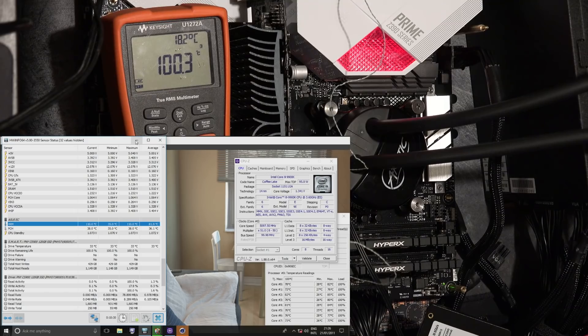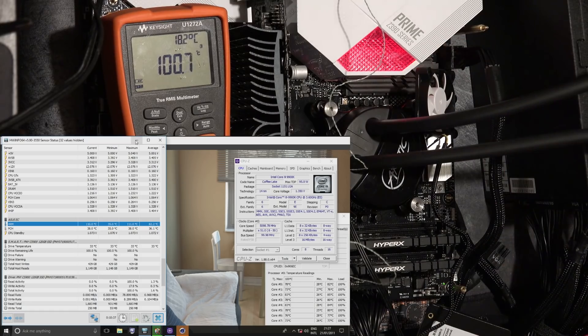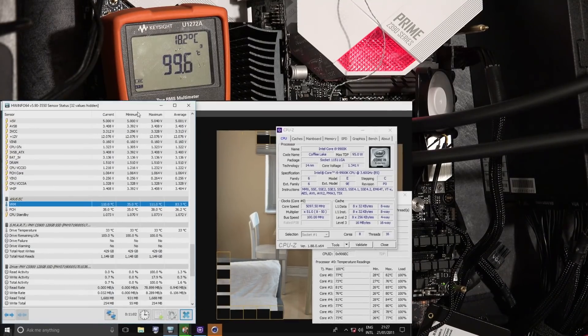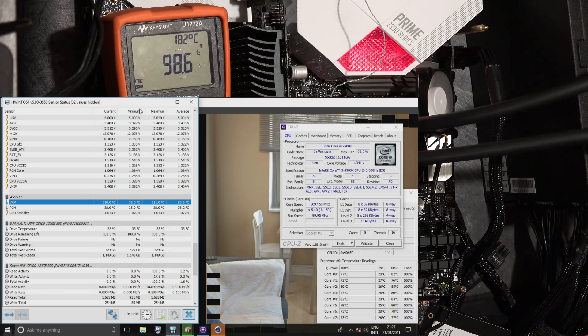So there's our little fan. I've put it in there and now I'm just going to turn it on to about 3000 RPM. It's so small it doesn't actually make that much noise, and it's about $5. There's a bit of lag before the fan actually starts having an effect. Right now we're at 110-111, but you can already see the K-type thermocouple temperature is dropping because it's measuring more like the PCB and heatsink temperature rather than the internal MOSFET temperature, which lags behind due to thermal resistance.